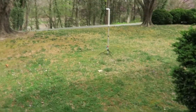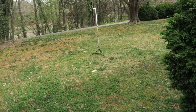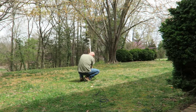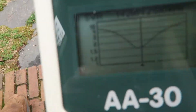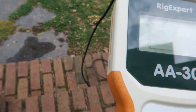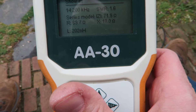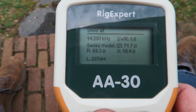That's it — completely set up. All you have to do now is hook up the coax and tune it. It's not tuned yet. Actually without any tuning it's not bad — I set the meter for 14.2 megahertz and the SWR is 1.6 to 1 on 20 meters without any tuning. I don't know if you can see that but that's not bad at all. I'm pretty happy with that.